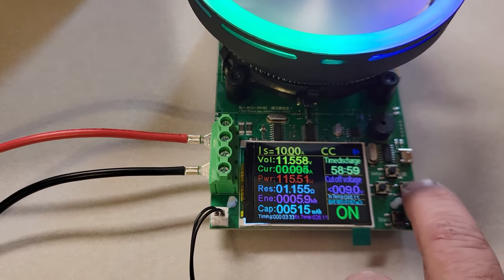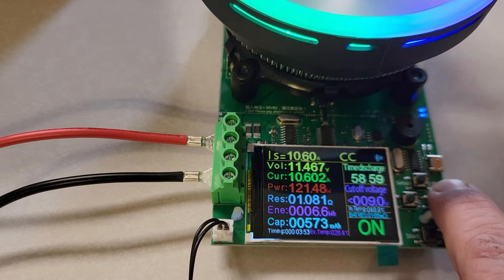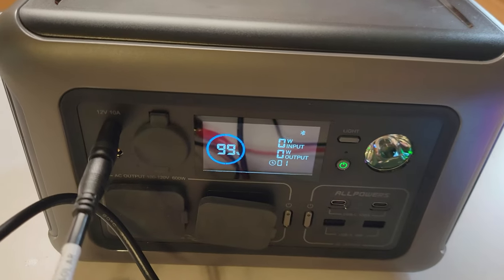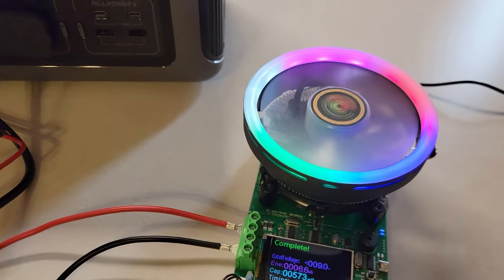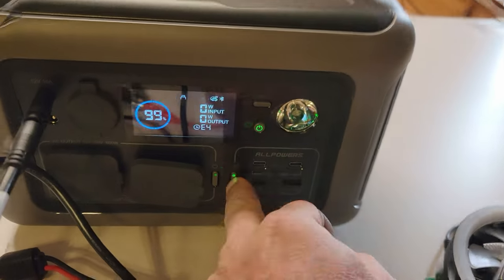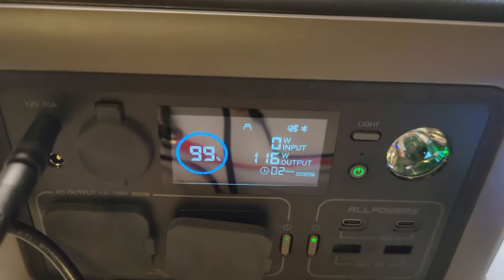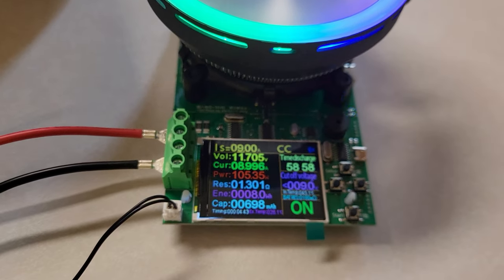Let's see how many amps we can go. There's 10.5 amps — voltage still hanging in there at 11.4. It overloaded there, so it's rated for every bit of the 10 amps it's rated for. This test proves it's actually producing the wattage they called for. We went off on an E4 error, so we restarted — voltage came back to 13.2. Back under load, it looks like we should get about two hours of runtime. We're going to let this run until it goes dead and see how many watt hours we get.